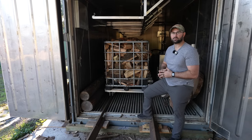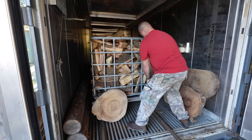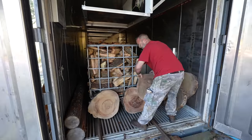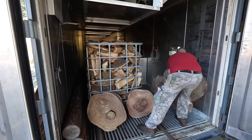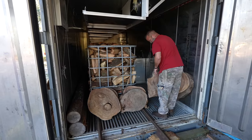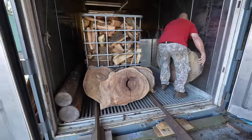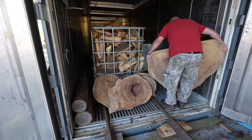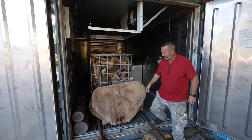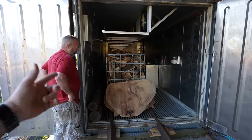We've got our four totes loaded into the kiln. I'm going to get these camphor cookies put back into place, get the doors wrapped up, and show you how we start it. Drying firewood at 130 degrees Fahrenheit is definitely not the correct drying cycle that the camphor needs — however, camphor is pretty forgiving so we dry these cookies at the same rate as the firewood. It does cause some cracking, but all of these cookies are pretty much going to be epoxy projects, so we don't care because we'll just fill them in the end. We've found we can dry these camphor cookies at two and a half to three inches thick in about 10 days — two cycles inside the firewood kiln.